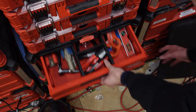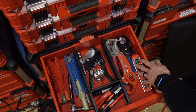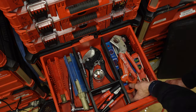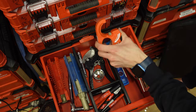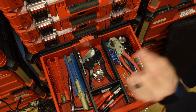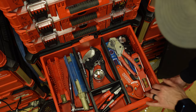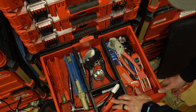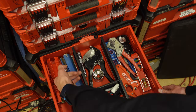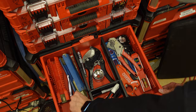Moving to the drawers in the second column of pack outs, this top drawer has my primary tools — my most common tools for installation. I have my torpedo levels, my PEX cutters, this P-trap cutting tool — it's pretty neat, puts a chamfer on the pipe. I have my PVC ratcheting shears there, my Sharpies, and a paint pen. I keep my faucet change tools there. This pass-through socket I literally only use for Johnny bolts.